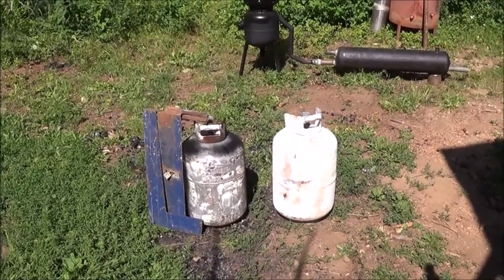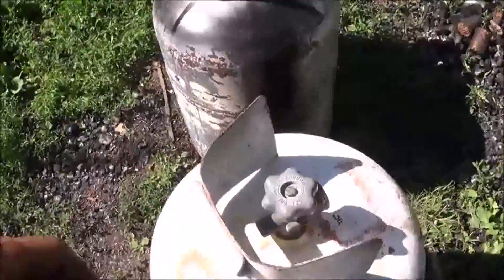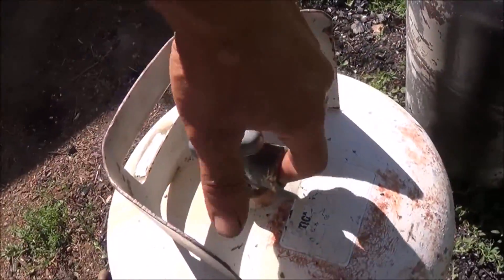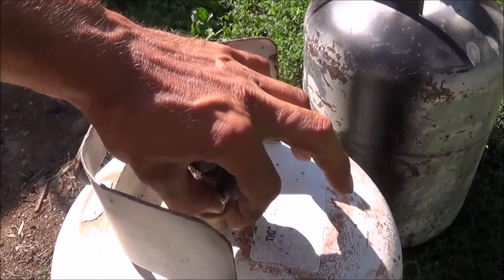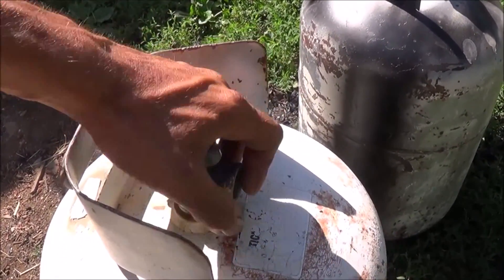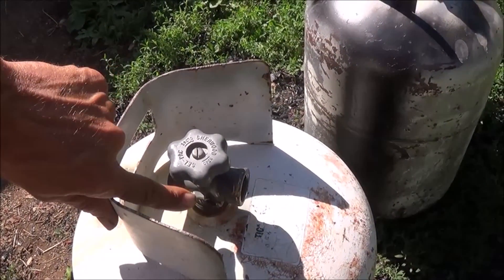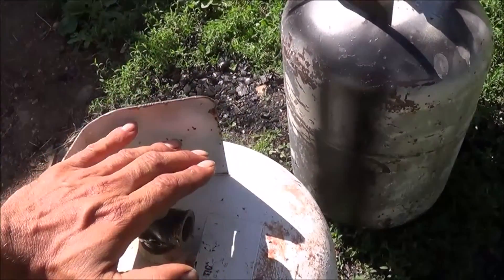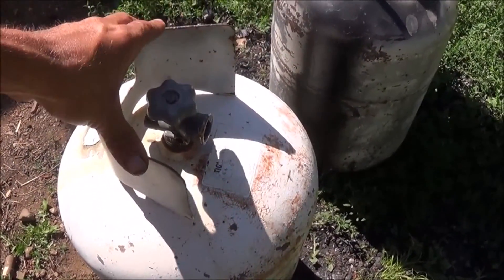So what I do is I fill them all the way full of water right into the opening of the valve here. I just stick a tube down into the opening, and because the bleed-off valve that usually goes right where the tip of my thumb is — there's a screw right there — that's out of there, and you can just pump water in. When it gets to the top, the water will come out your bleed-off valve, letting you know it's full. I keep water in that the entire time I'm cutting into it until I've removed the larger section.